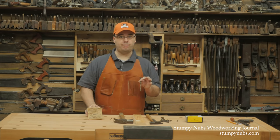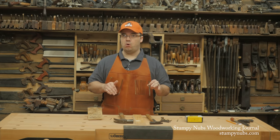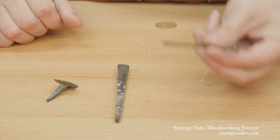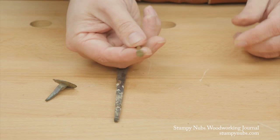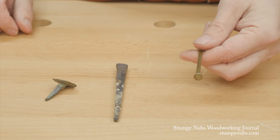It will, however, spread the fibers along the grain, tightening the nail in the hole as you drive it deeper, as we explained before. On the other hand, you can bore a pilot hole for a wire nail, and you may avoid splitting your material, but the gripping power is dramatically reduced without the wedged profile to grip the interior of the hole.